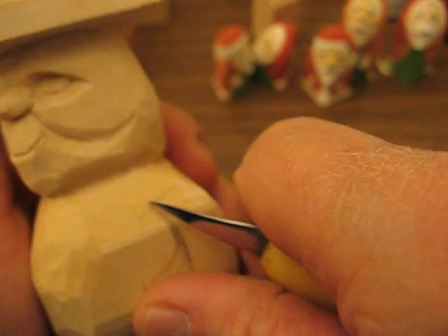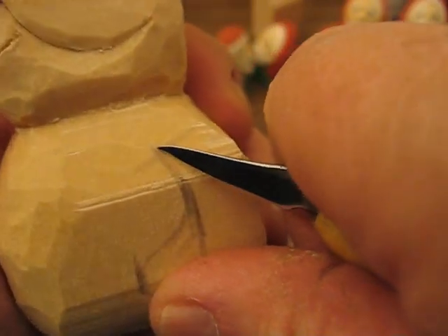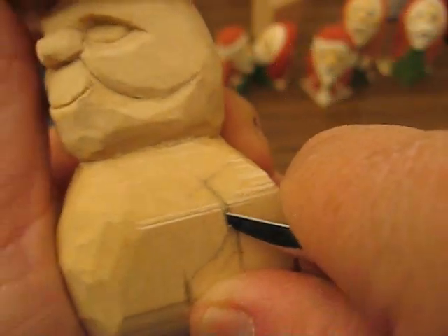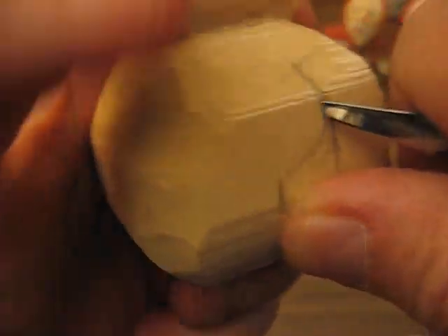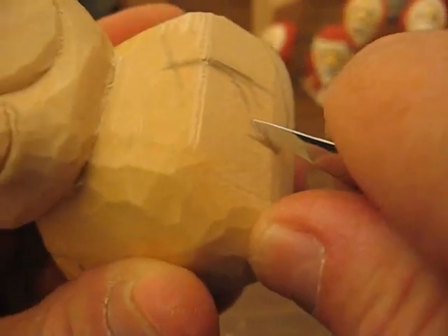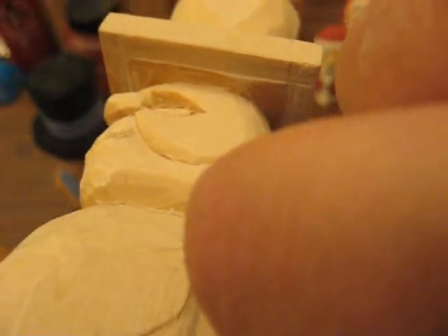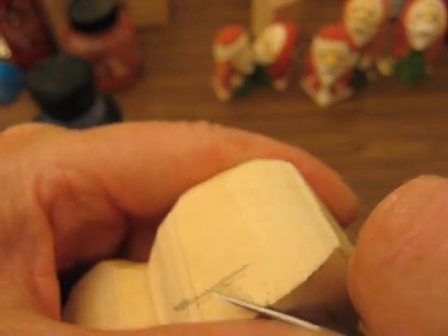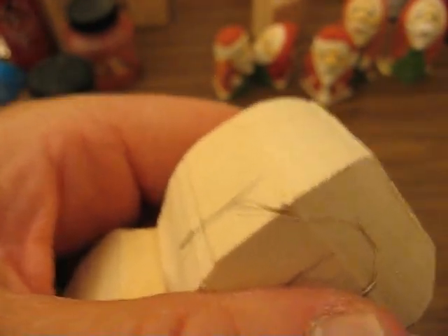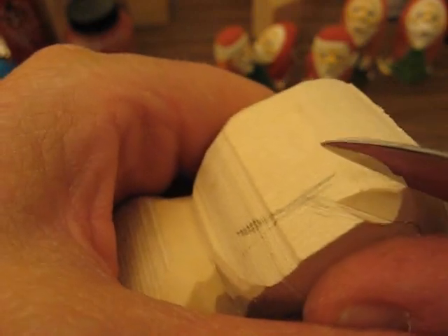So I'm going to start cutting out the arms. We're going to take it just like we did with the Santa. We're going to go to the top up here, dig it in, go to where the elbow is — make believe there's an elbow here anyway — now we're going to turn it, like so. You're not going to take that blade out; you're going to leave it in there and follow that mitten all the way around until you get to the straight part. You're going to cut this out with a stop cut and chop the little pieces out, just like that.